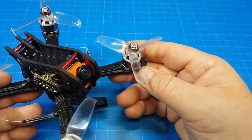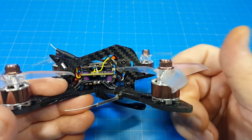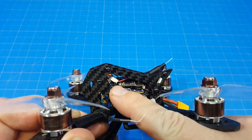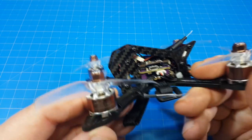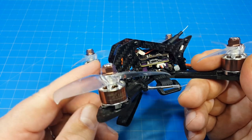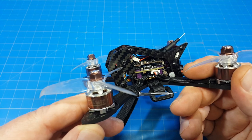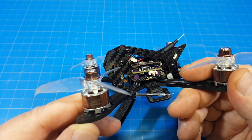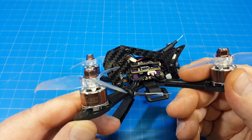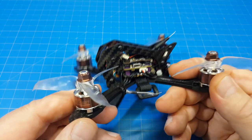The only drawback to be aware of — I've already mentioned — is that I had to reverse the VTX to get that connector away. The VTX and the camera connector lined right up, and so that decreased the camera angle. It didn't necessarily feel slow in the goggles, but reviewing the footage it did look quite a bit slower than what I normally fly in the backyard. But it did make it quite a bit easier to fly.